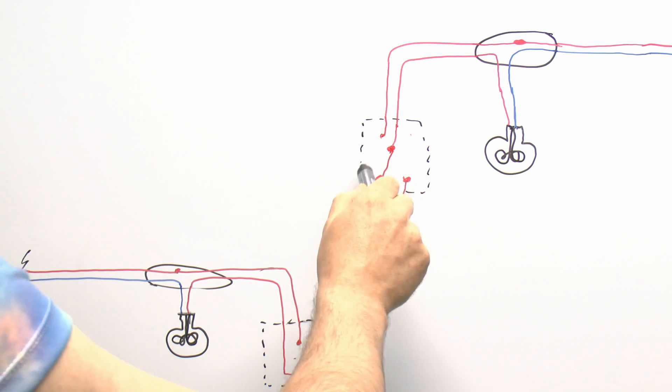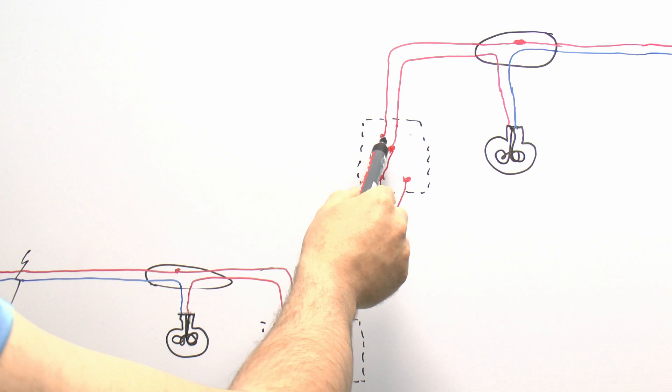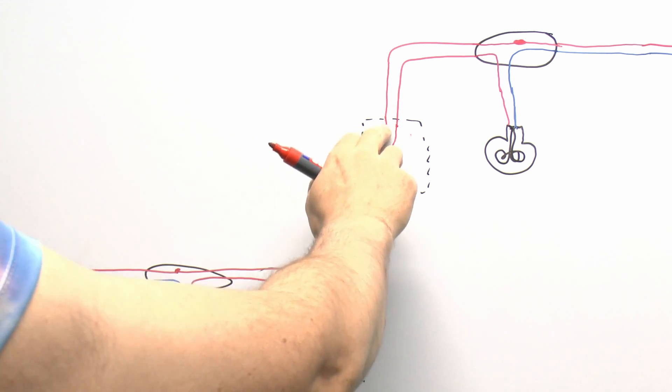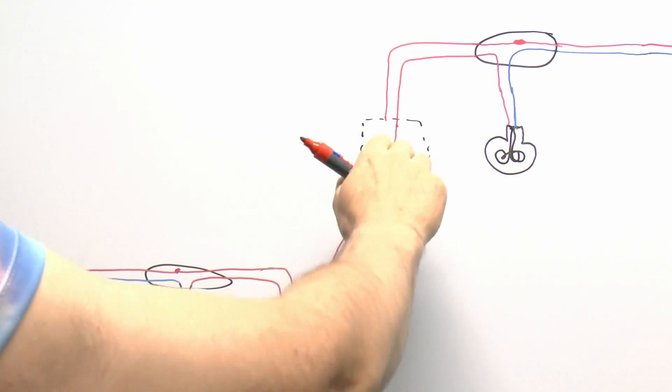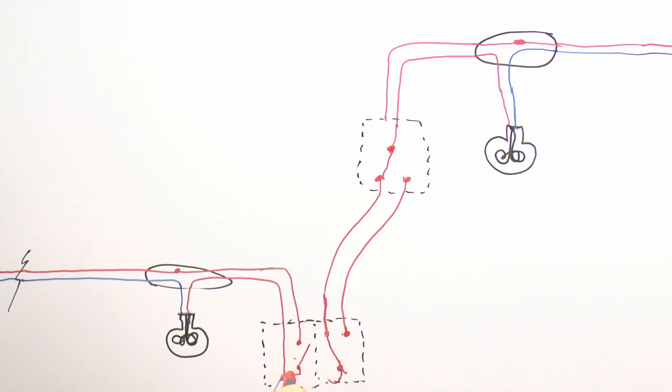In this situation you can't actually complete the switching arrangement because there's no power at the upstairs switch — the permanent line isn't actually connected to anything there. Even if you connected it to one or more terminals in various combinations, the best you can do is switch the light on at one switch but only if the other switch happens to be in the correct position, which makes it pretty much useless. What has happened in plenty of properties is a cheat — the permanent line coming in here isn't connected, and the power for the whole thing is actually taken from the other switch, which is probably on the same plate, by simply putting a link between them.